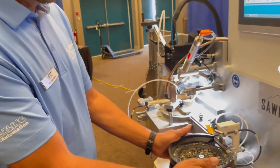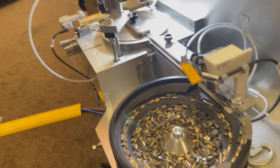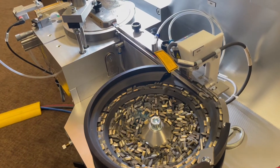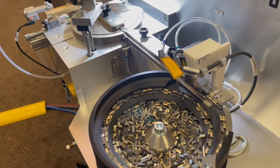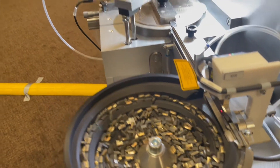The tip sorting is done with a vibratory control and a laser measuring system. We teach the laser measuring system the proper position of the tip, then turn it on to a run function, and it only accepts that position or profile from that point forward. We can go ahead and activate this and turn it on. There's one position it will accept — it blows everything else back into the bowl. The tips that are correctly oriented go down the track, the feeding belt, and they come into a rotary table.